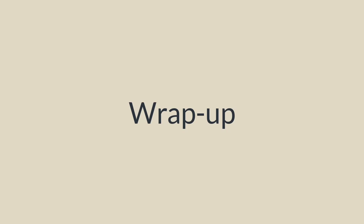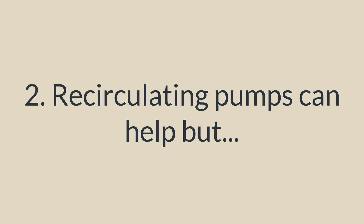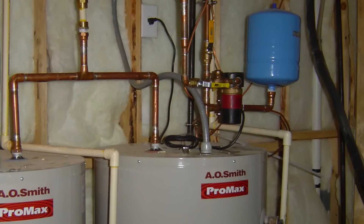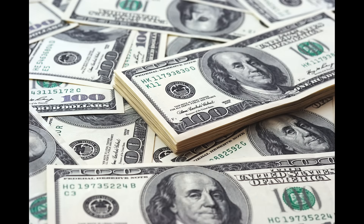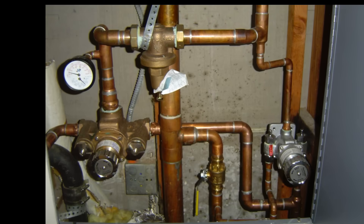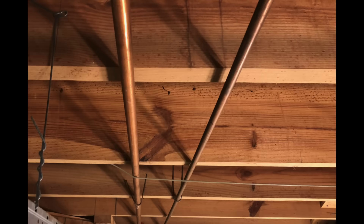Let's wrap this up with a summary and some cautions. The basic idea is to use shorter pipes and smaller pipes so that you have less water to push through before the hot water arrives. The most common recommendation for reducing hot water wait time is to use a recirculating pump, which comes in two varieties. A continuous recirculating pump means no matter when you open a hot water tap you'll get it right away, but you pay for it — the pump runs all the time, and you have heat loss happening continuously, especially if you don't have insulation on your hot water pipes.